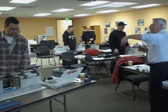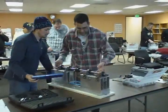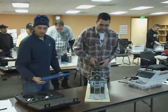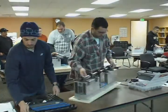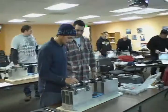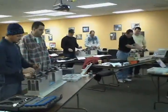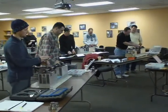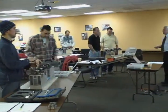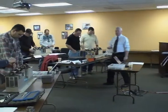That's your motor — turn it around. Jacking bolts will be on the right; that will be what we're moving. The reason I'm doing that is you're going to look at the board first so you understand what we're doing on plotting. We are going to plot this so you understand what we're doing. You're going to need your colored pencils and your graph paper.